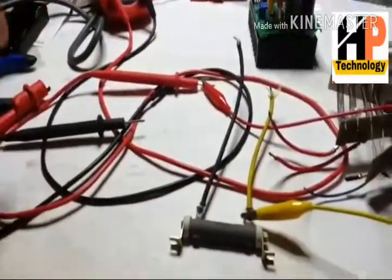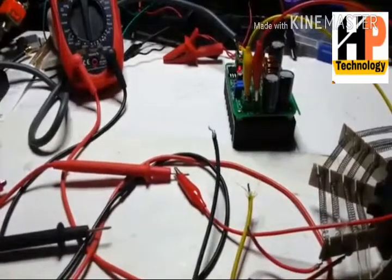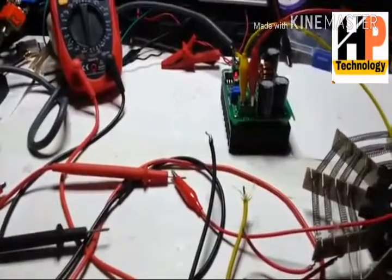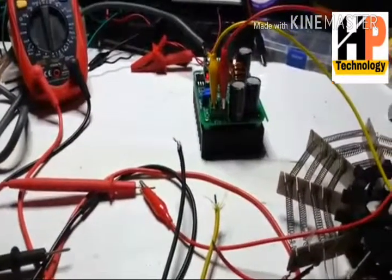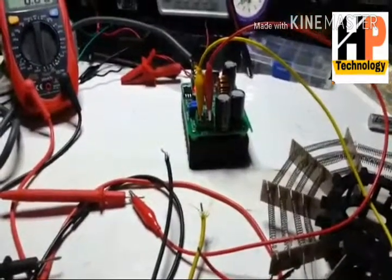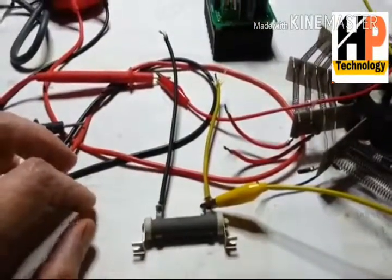Okay, that's starting to smoke already, but that's because at 40 volts it was drawing about 3.5 amps. Yeah, 3.48, so let's say 3.5. We've got smoke coming off that now, so I'll let that cool down. So 40 times 3 is 120, plus half of that, so it's not 130 watts. Oh, sorry, 140 watts. So it's delivering, but do you hear the noise it makes? But there is 140 watts there that can be delivered.